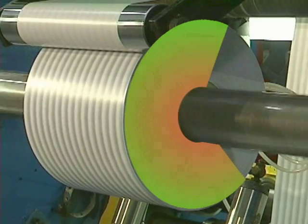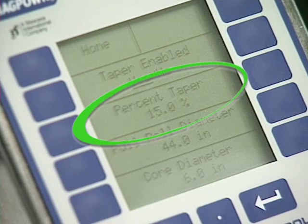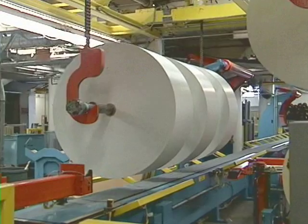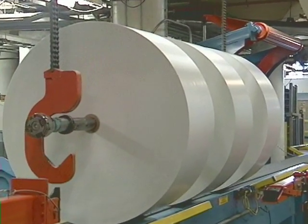This is accomplished simply by selecting a percentage of tension to reduce over the course of the roll. Taper tensioning can improve the quality of your rolls, reduce the amount of scrap, and lessen the frustration and lost time that come from rolls without tapered tension.